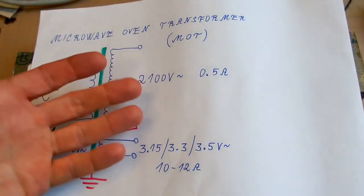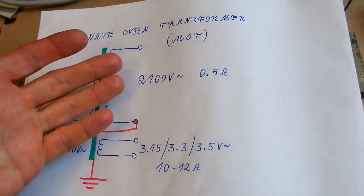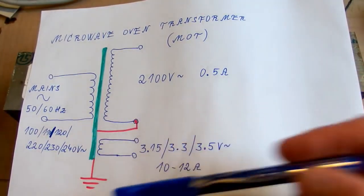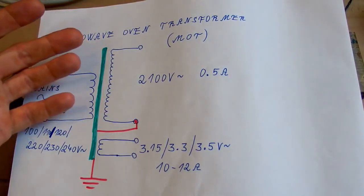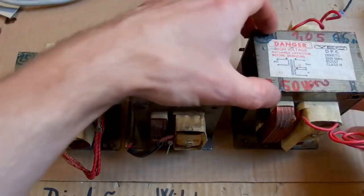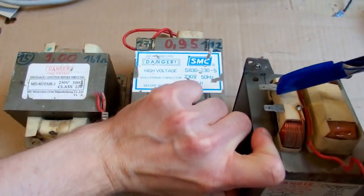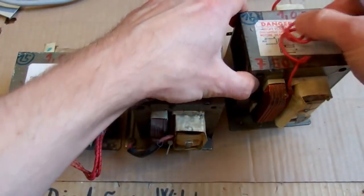The 2100 volt output seems a bit too low for a Tesla coil — not low for an unlucky person who touches it, it's absolutely deadly, but a little low for a Tesla coil application. You can put more in series for more voltage, but because one end of the secondary is grounded it's a bit tricky to put more than two in series. They are also not very well current limited, so you have to use something external for current limitation.